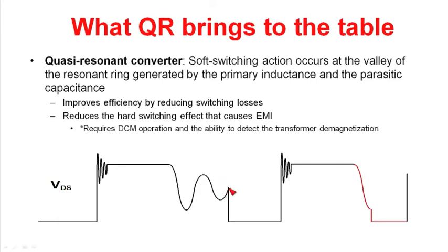What we'll see is the MOSFET turns on. And if we had a curve of the magnetizing inductance current, you'd see the current increases as long as the MOSFET is on. And then you turn the MOSFET off. The drain voltage gets driven positive by the magnetizing inductance of the transformer until it gets clamped to the output voltage. At that time, the magnetizing inductance discharges into the output filter capacitor, delivers load to the output. And then finally, the current returns to zero, and the output diode in the flyback turns off.